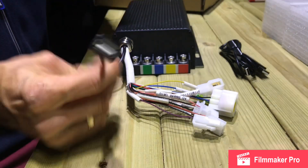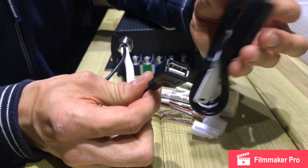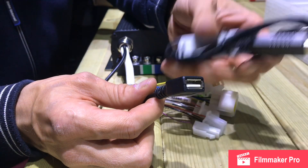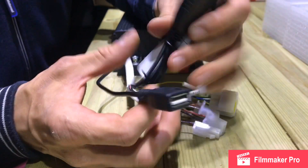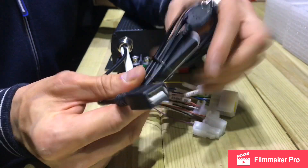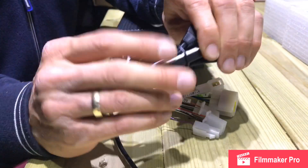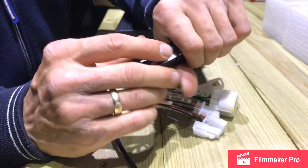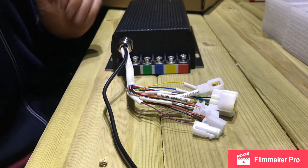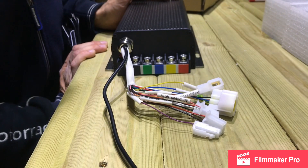The last one is the USB plug. It works with the standard cable provided with the controller and you can then adjust all the settings, but only through the Windows app — there's no Mac version for the Sabvoton. Some features can only be done on the desktop, you can't do everything on the iPhone or Android application. The Bluetooth module works really well though — all the basic stuff, checking temperatures, it all works perfect. But there's some stuff you can't do within the app, so you need a Windows PC to access all the features on this controller. Thanks for watching — if you've got any other questions please leave me a comment below.